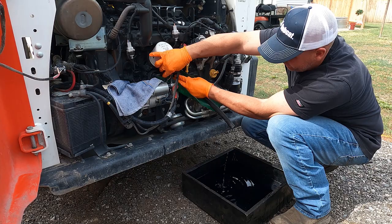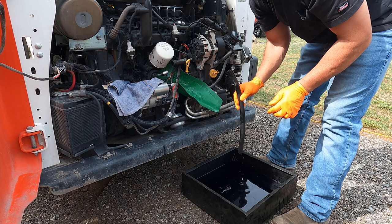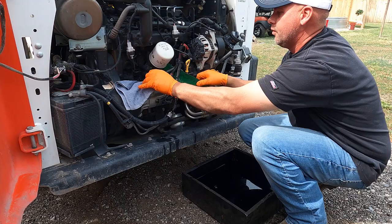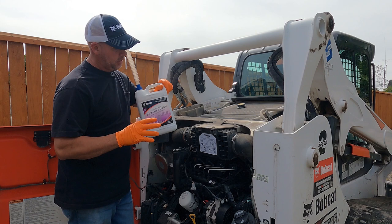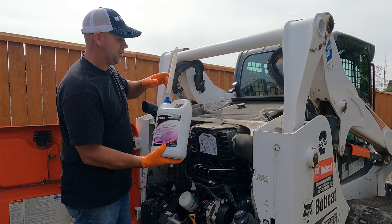We'll pull off our little piece of 5/8" hose and reconnect the oil cooler hose. Then we're going to refill our system using propylene glycol. Don't use the green stuff from O'Reilly — just get the correct solution from your Bobcat dealer. Propylene glycol is a purple coolant. If you ever use diesel exhaust fluid, these fill spouts are nice — they fit right on these coolant tanks, and that's just how I like to fill up these systems.